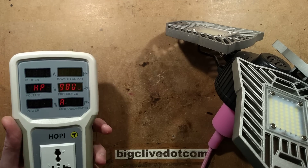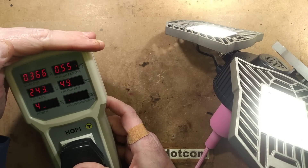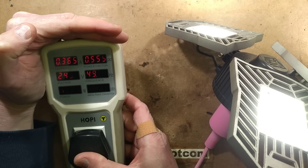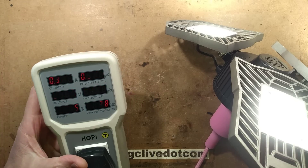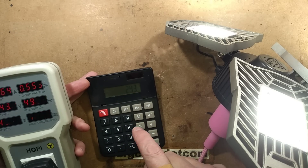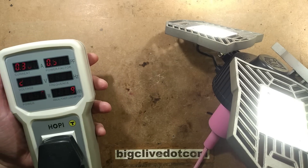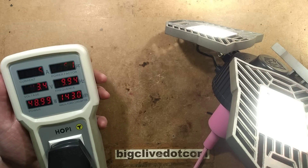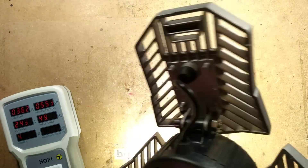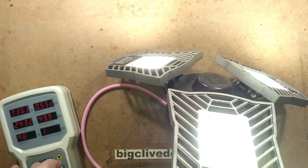Here's the hoppy — let's plug this in. Hoppy flickering away. The 60-watt light is drawing actually almost 50 watts. Current: 365 milliamps. Power factor 0.5, which is pretty terrible. The apparent power would be 243 volts times 0.364 — just short of 90 watts. But actual power being used is approximately 50 watts; some of that will be losses in the driver. And it's very bright. It competes quite favourably in a room. Note there's no flicker — this is good. The hoppy does have flicker.